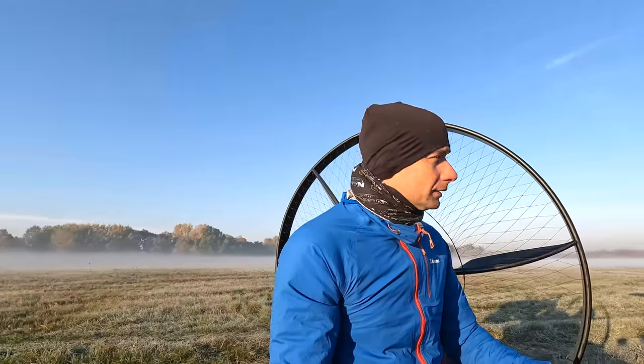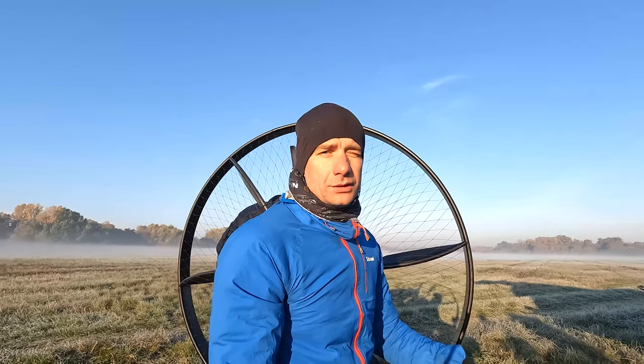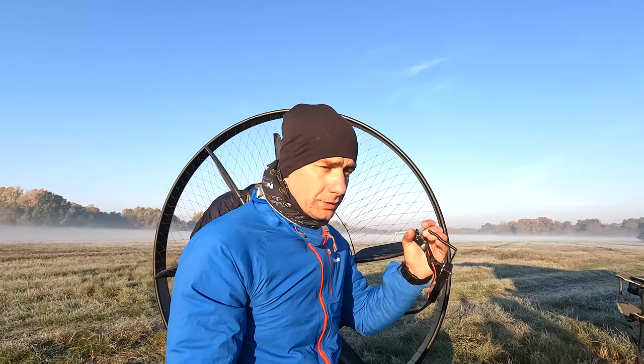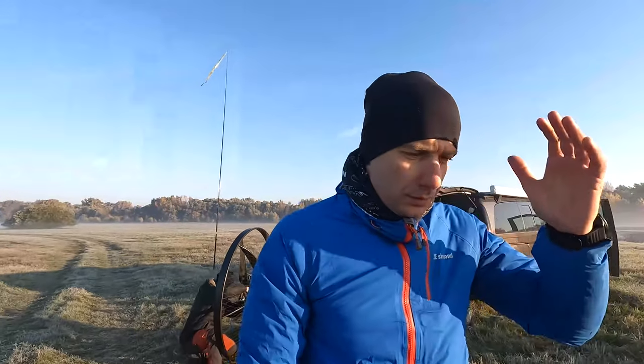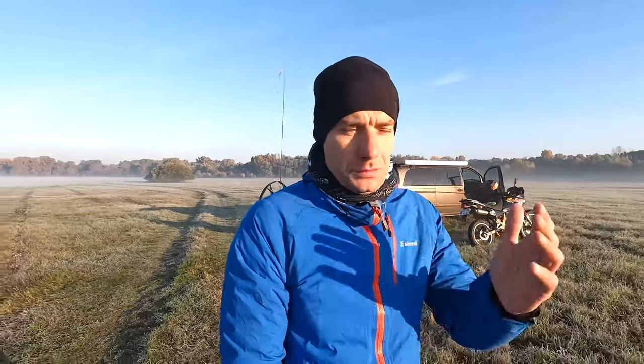Well, the thing is that if there is friction, it can ruin the feeling of it. So the modulation that we are expecting, the benefit that we are expecting from this throttle, is that I have longer travel, eventually non-linear travel, and I could be able to dose throttle very, very smoothly and in very, very small steps, or actually continuously. Now, if the friction is involved, I need to apply some pressure and the throttle still does not move, because I need to first overcome the friction. So I'm increasing the force, and the moment I overcome the friction, it would suddenly jump a little step. So in that case, adding throttle would be in little steps, not fully continuous.